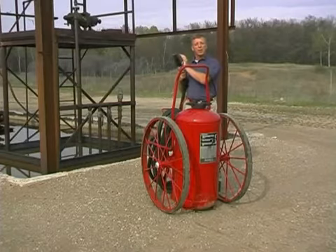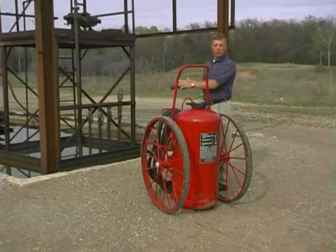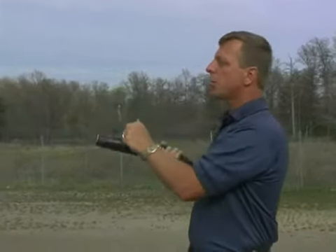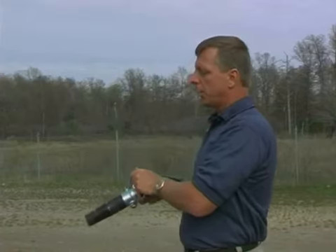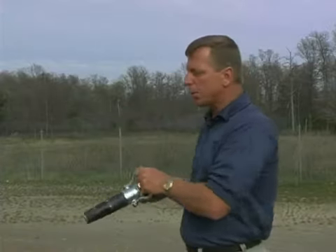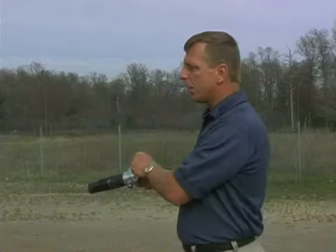To fight this fire, you have to put the ground fire out first. Position yourself 25 to 30 feet away from the fire, open up your nozzle, and get your aim at the base of the fire. Once you get your aim at the base of the fire, establish your sweep. Once the ground fire is knocked out and pushed back, the next fire to work on is the gravity fed.